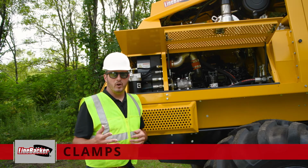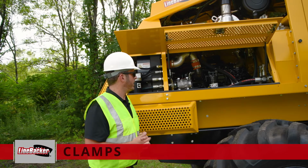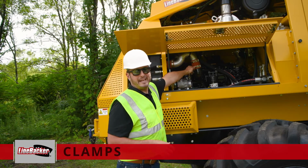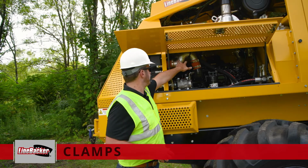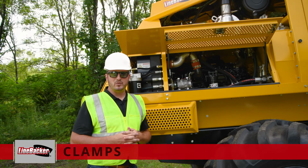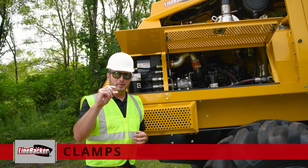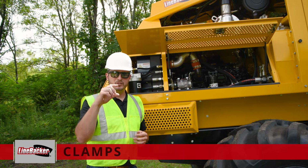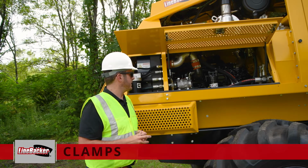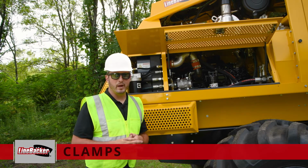As you're walking around the machine every morning, inspecting it before you get out on the job site, just be sure you're checking these clamps around any air handling pipe. You want to be sure that those are tight. There's little springs on those clamps. You want to be sure that those are completely collapsed. If you see any gap in between those spring coils, you want to be sure to grab a wrench and tighten them up so that there is absolutely no way that that band can be moved or shuffled in any way.